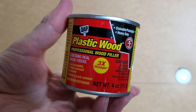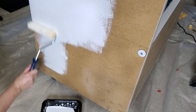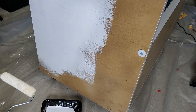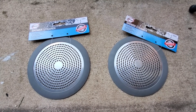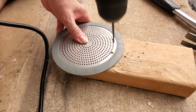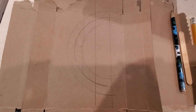Next I filled the holes with wood filler so I could paint the brown sides. Once it dried I scraped it off with a razor blade. I used zero-VOC paint, which has almost no odor — great because I could paint in the room without worrying about fumes. Unfortunately the paint was a little tacky after it dried, which made the door covers stick and not slide as easily as I'd like. Next I worked on the door covers — it's a very simple design, just drain strainers screwed in at the top. I drilled one small hole at the top with my power drill. To make the door stops I used a compass to measure and draw the shape onto cardboard to make a template.